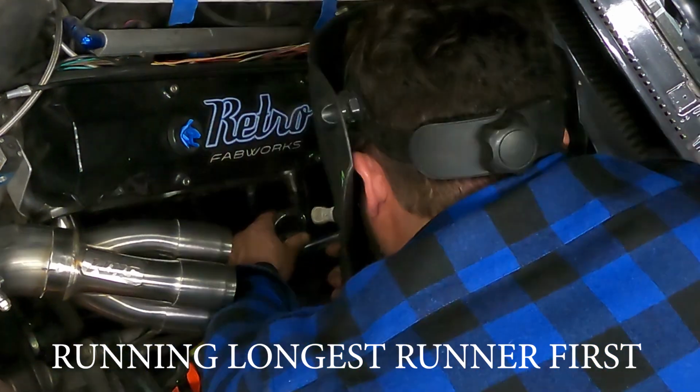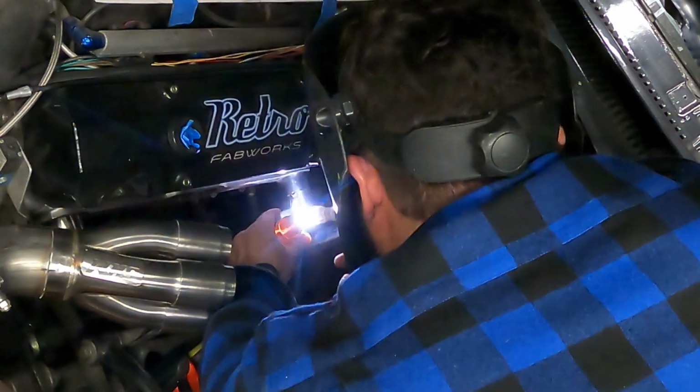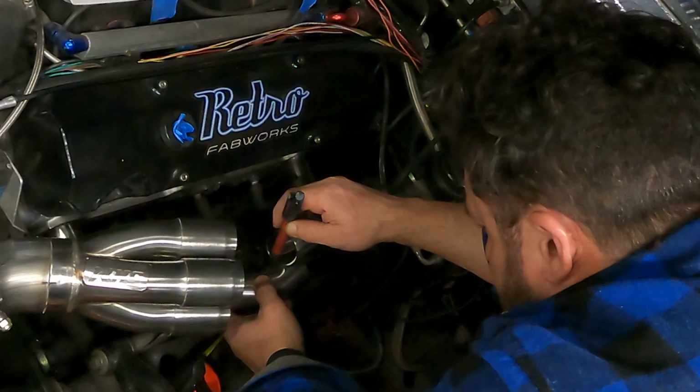It's all programmable. And then from there, the only thing I started to run into, which we're getting to in this episode, is when I brought it to dyno last to push it past 1,000 horsepower, I was running into a bunch of backflow issues. The old style headers were a little bit choked up for this. The turbos were a little bit smaller.